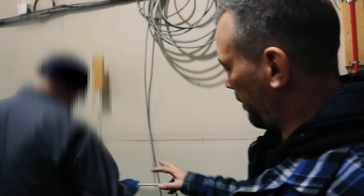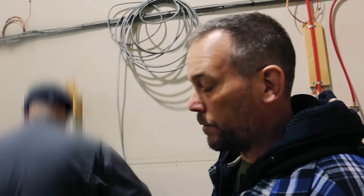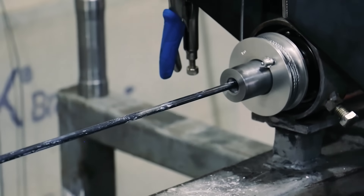The button gets inserted through the bore and put onto the hydraulic machine, and it gets drawn through the bore — basically engraving the rifling into the pre-cut and reamed bore. We make about 15 barrels a day. We're not a high-quantity producer, but the barrels we do produce are super high quality. We're looking for quality, not quantity.